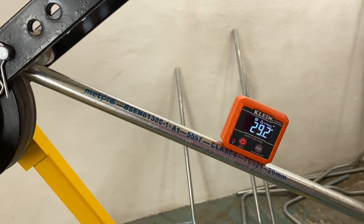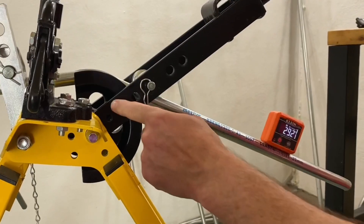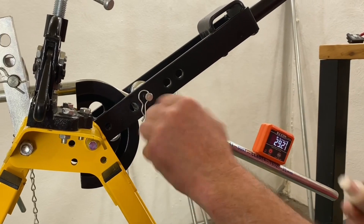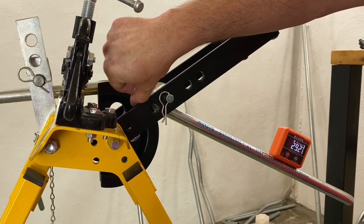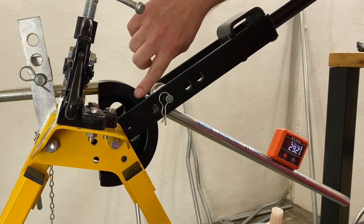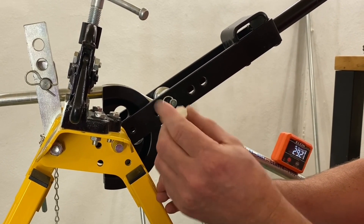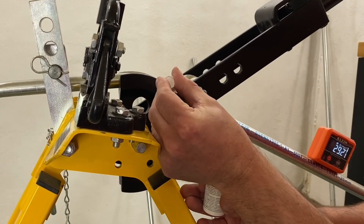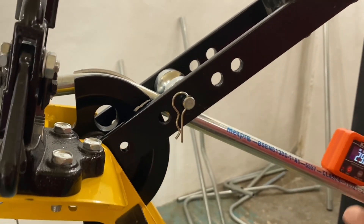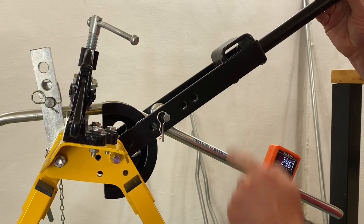So there's your top tip with an inclinometer. Here's some correction fluid, and I'm going to show you a top tip using this. We can see the roller bar — the arm of the conduit bending machine — which we've discussed in a previous video. We've got a marked point here, and if I put a line there, I'd know when stepping back that it's approximately 30 degrees. So I'll take my correction fluid and paint a thin line right there.